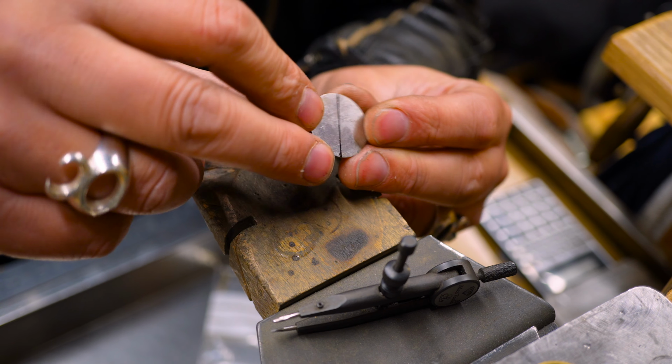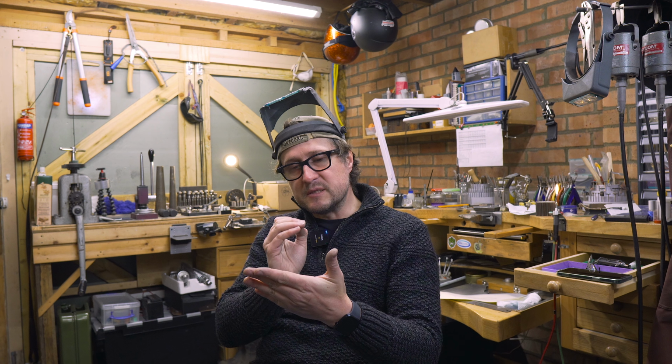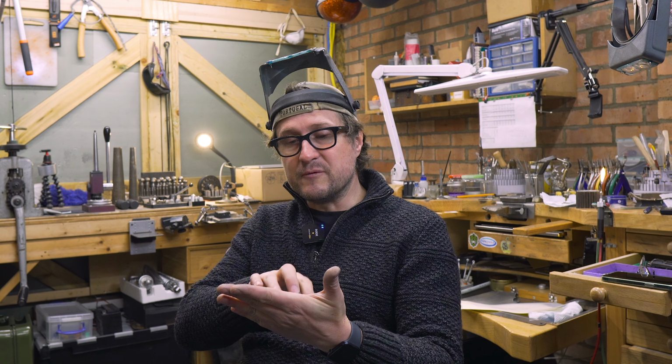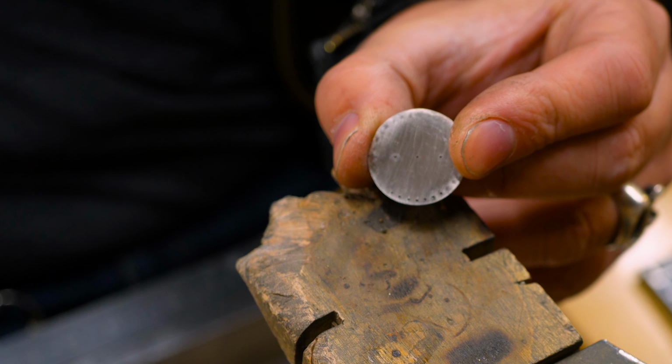And I'm doing this because if you're turning it around, I already have a hole at the back that I've created in the middle. I can take a small drill and just go through that hole and mark where the trophy lies on the actual pendant. And then from there onwards, doing two additional holes that go through the pendant, through the platinum pendant, right into the back of the trophy.